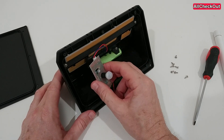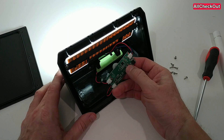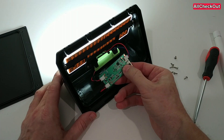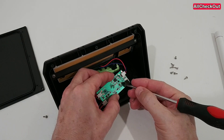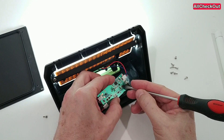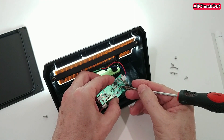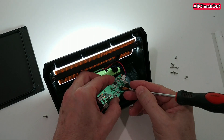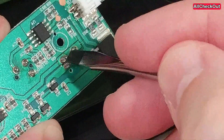Always make sure you have the solar panel facing down when working on this, and only then will it work. Here we really have some weak contact somewhere. You can use the switch over and over and it always works for a short time, and the light is very bright — so it's definitely not the battery. I think I've found it: there are these two pins on the right side, and when I connect them it seems to work. You could connect these two pins with a little bit of solder.